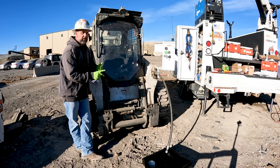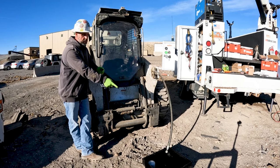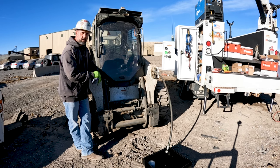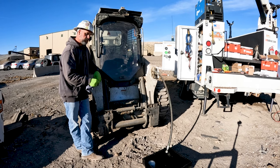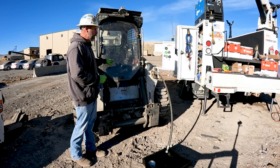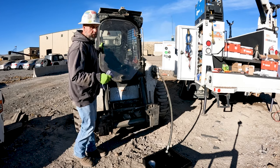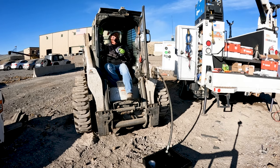What you need to know is: when your pump runs out of oil, you're not cavitating it — you're aerating the oil, which are two different things. Not all the oil is going out, so you've still got plenty of oil in there to lubricate your pumps until you get the machine shut off. We're just going to pump oil out until we see it get a little foamy, then we know the tank has been completely flushed out. Then we shut the machine off, change the main hydraulic filter, and fill the tank back up. This machine has 8,000 hours on it; this is the eighth time I've done this process and I've never had a single hydraulic issue.